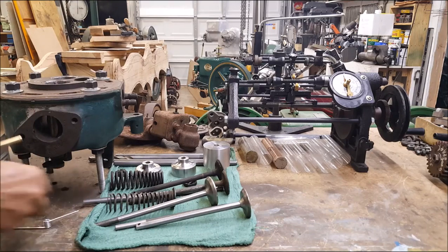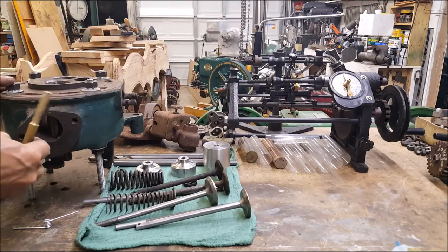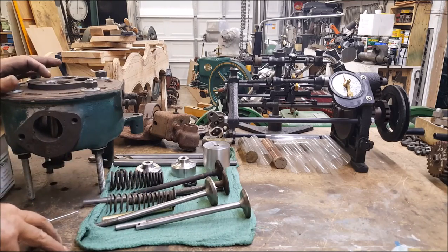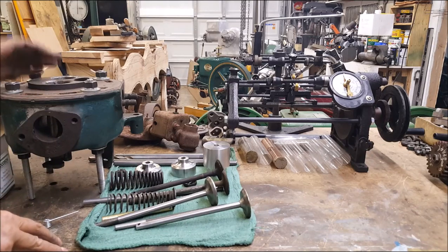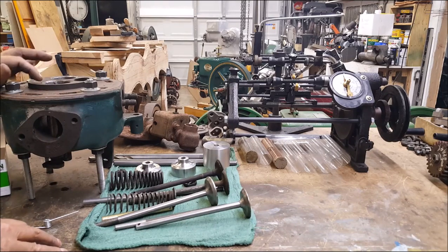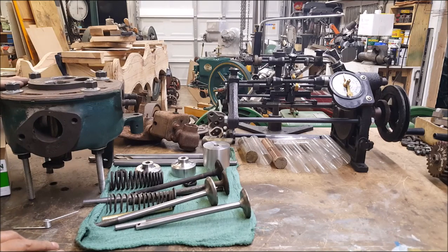Well, I did make a preliminary cut with this one that I made. And it probably would be all right to use that. But you know, my thinking, if it's off half a thousandth or so on my part, on my lathe over there, that I would rather wait on the job. And I ordered a pilot to go down in there and be able to use this thing right here with the correct tooling. So it's on back order. She said it possibly be 3 weeks on back order. So I'm gonna wait on that. I feel I do a better job.